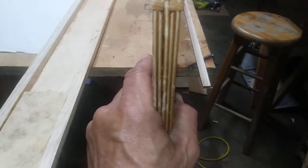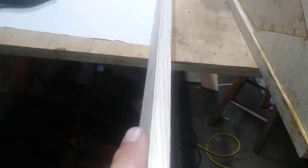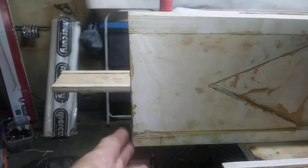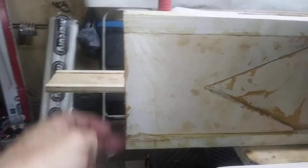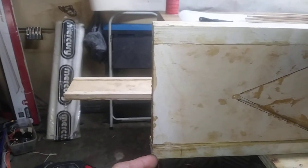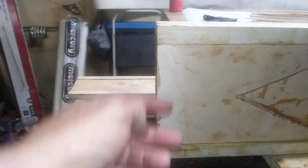Just build up whatever width you need for your carry-through. The rear spar typically is not slotted — it's just glued onto the web, and smaller. Build it up, and then if you can see the slight angle — this is the top and that's the bottom — that's to get your dihedral. On this plane it's one-quarter of an inch; I think on average it's about a one-and-a-half degree angle.